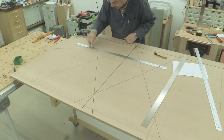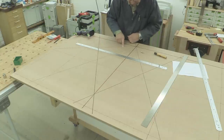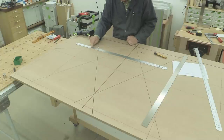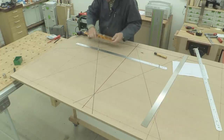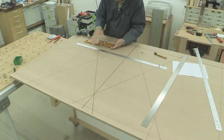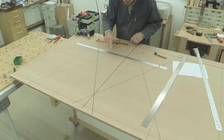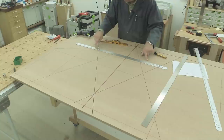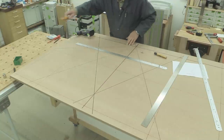And so I've picked up one there, and that's put that path stick in the right place, which means I can now drill here, which I've actually already done in my practice, which puts a hole along that black line. Now we're going to have to drill that out to make that a 20 millimeter hole. Therefore, in order for the guide to work, we need some 3 millimeter holes all around it. And we actually need to have a 20 millimeter hole there, one on each of these black lines. So actually it's going to be a good idea to fill in several of these intermediate 3 millimeter holes now.